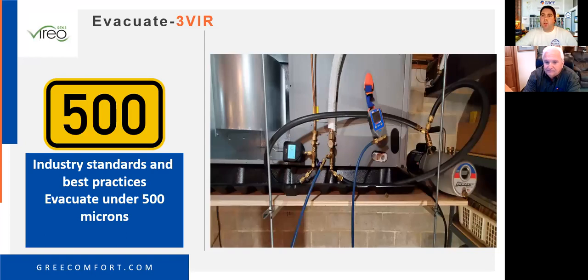All right, and then after we've done our pressure test, we want to remove the nitrogen, and we want to make sure that we do a proper evacuation. Now, as I was looking for a picture of my 3 VIR, I didn't find one that I had taken of the vacuum pump and the micron gauge, so I just used this picture here. As you can see, we've got the micron gauge as close to the service valve as we can get it. We want to make sure that the micron gauge is away from the vacuum pump, so that we're getting an accurate reading of what we're actually pulling it down to.